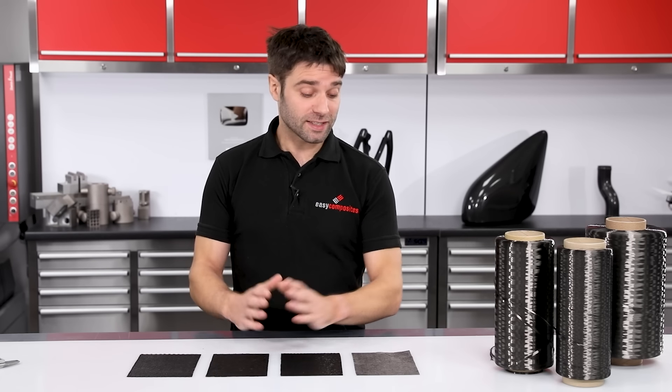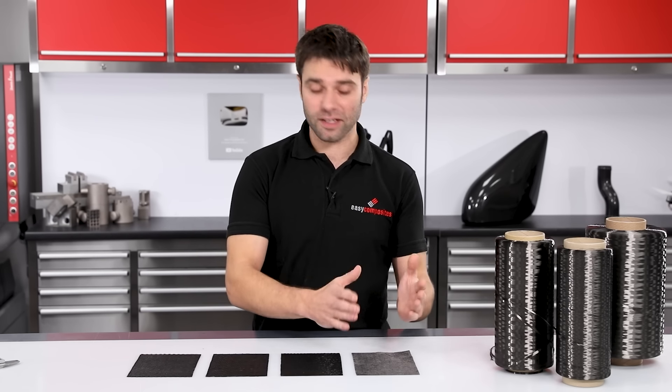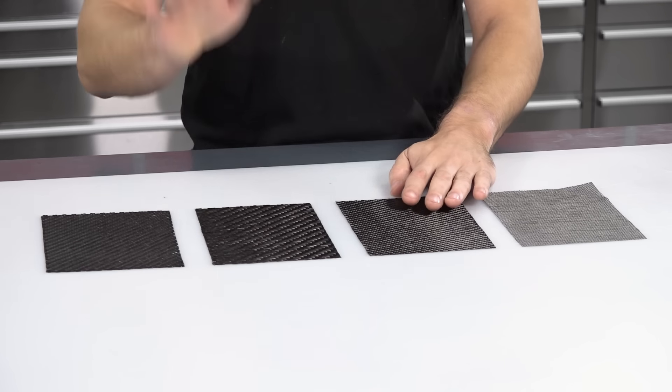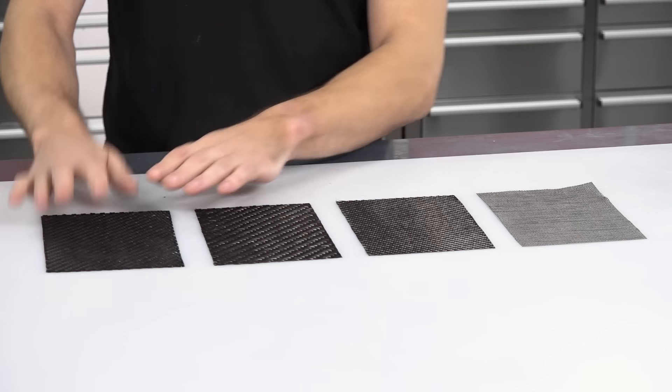If you don't know where to start on panel thickness, a rough estimation you can use is to equate it to mild steel — for any given thickness of carbon fiber it will perform in a similar way to mild steel. Now this is really an oversimplification, but if you're just looking to replace a steel panel with a carbon one it's not a bad place to start. The range of weights typically starts around 80–90 grams per square metre, going up through 210 gram, 450 gram, 650 gram, and can get much heavier, though most general applications stop around 600–800 grams per square metre.